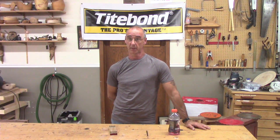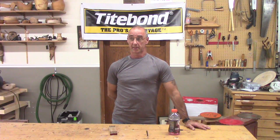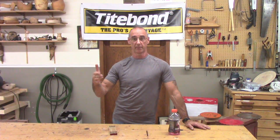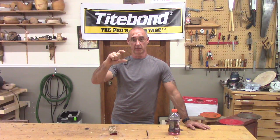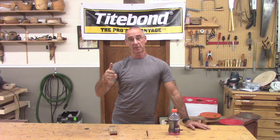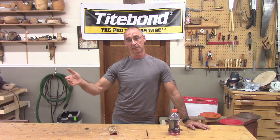It depends. As a general rule of thumb, air drying takes a year per inch of thickness, and then some people will say plus a year. So you've got 7-quarter, that means it's 1.75 inches thick. For the sake of making this easy, let's just call it 2. So following our general rule of thumb, a year per inch of thickness, you've got 2-inch stock, it's gonna take 2 years to dry. Then, like I said, depending on the part of your country that you're in, some people will say plus a year, that means 3 years for it to dry.